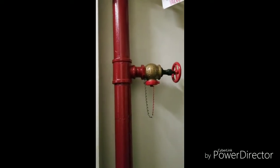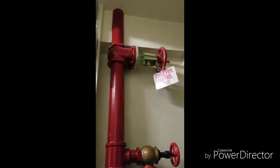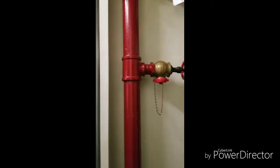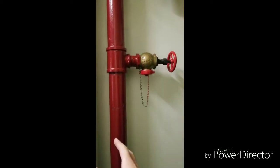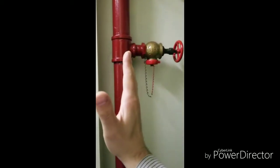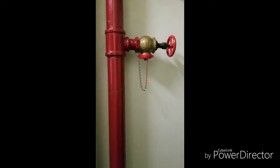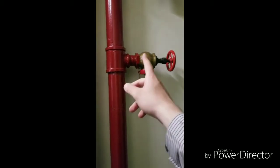Now there are different types of standpipes. This standpipe in particular is called a wet standpipe, which means there's always water in the pipe being fed from the gravity tank. A dry standpipe has a special valve, meaning that standpipe is under air pressure — an air compressor fills the pipe with air. When you open the valve, the air pressure decreases, releasing the flap, and then water comes through to feed the line. The only disadvantage is it takes a couple of seconds — maybe a minute depending on how far you are — for the water to come out.